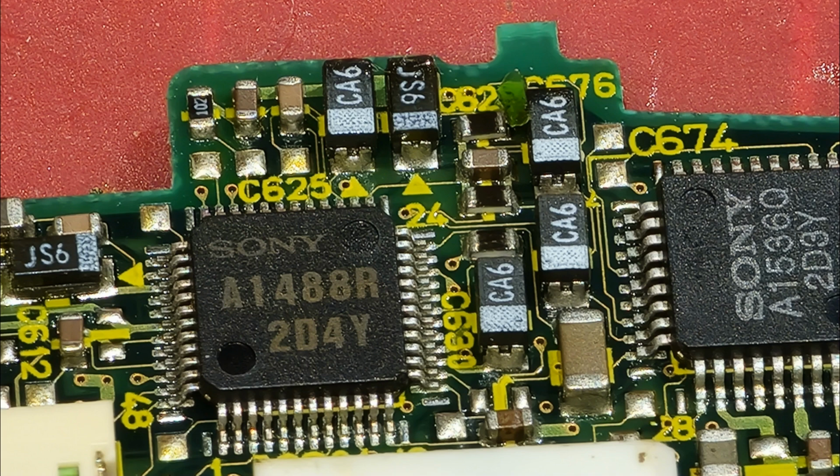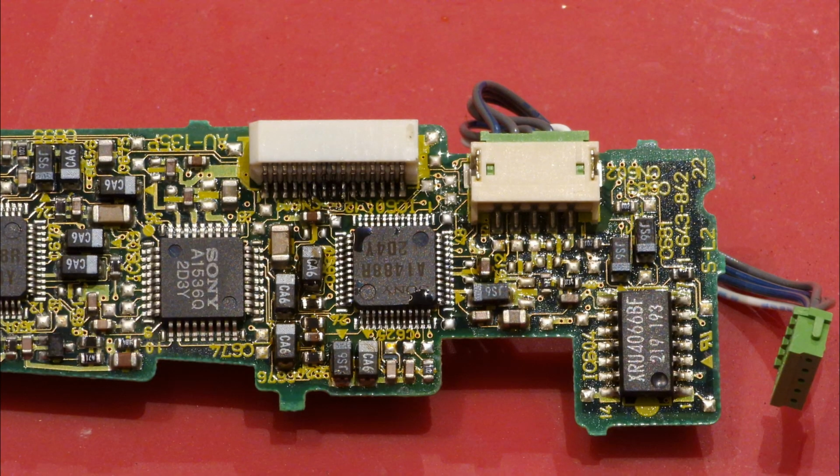While repairing the audio board, I apparently forgot to hit the record button on my camera. Therefore, there are only pictures of the audio board before and after I reworked the solder joints. There was quite some gunk beneath the chip, which caused the RF to be distorted, because this chip is actually extracting the audio from the RF for one of the two channels. Anyway, let's check out the reassembly.